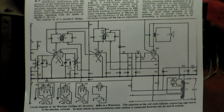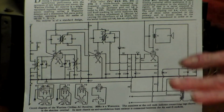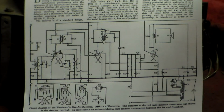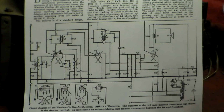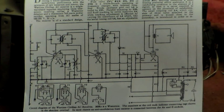Any set of this kind, of course, uses a 5 volt rail. But check for the voltage as well, because of course these are directly heated cathodes. They're directly heated, so the cathode also carries the HT as well. Things like the 6X5 don't. So that's the main difference there.